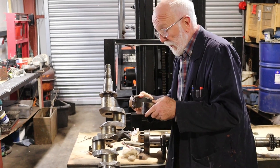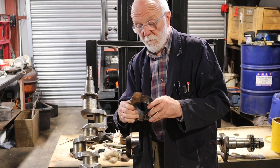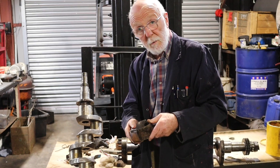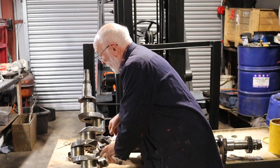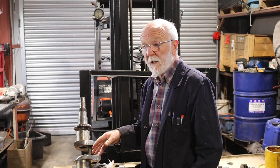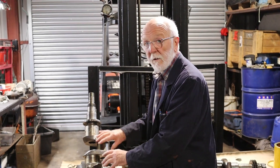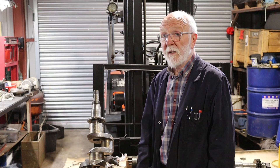So if the shells get worn — in other words, they're moving out from where they should be — then obviously the pressure will drop. That's why oil pressure is so important, because oil pressure tells us everything we want to know about the health of the crankshaft. And if you don't have a healthy crankshaft, you don't have a healthy engine. It's really very critical.